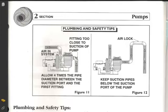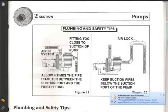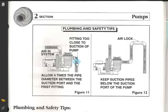There's a lot of things we can talk about, but when you move a body of water, it's called hydraulics. So there is this pump, and what's happening is they put — and you see it all the time — they put a 90 right before the pump. Sometimes they have a three-way Jandy valve so you can turn off your skimmer or main drain, and they come with a piece of pipe and then put a 90 just before the pump. When you do that, it's called cavitation, and it's creating air bubbles.